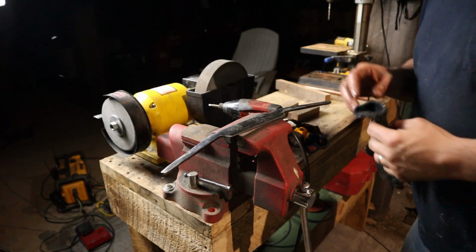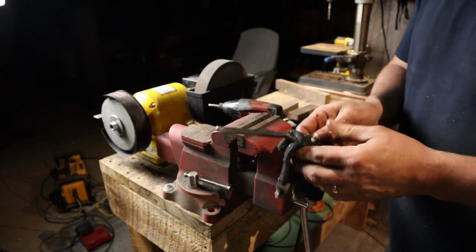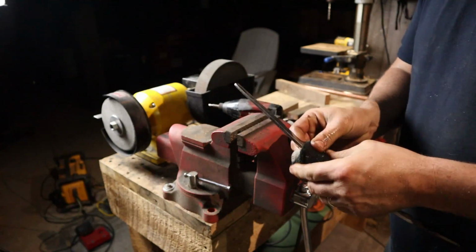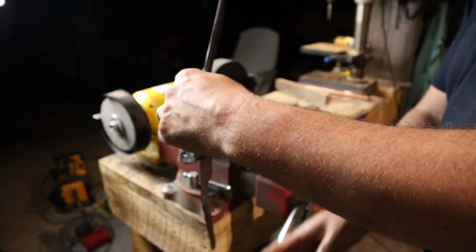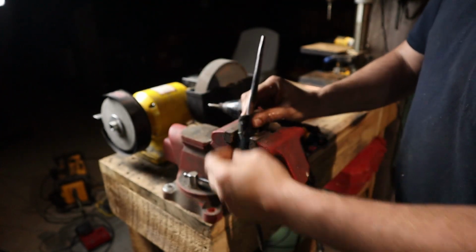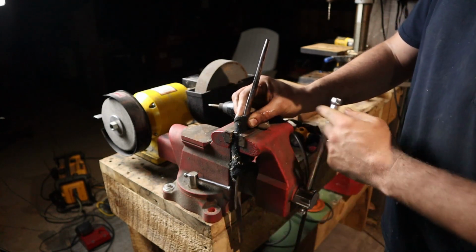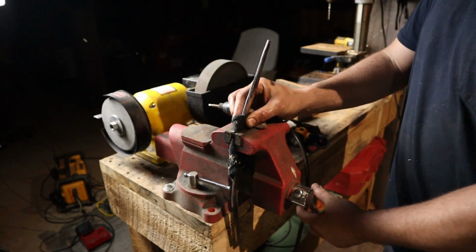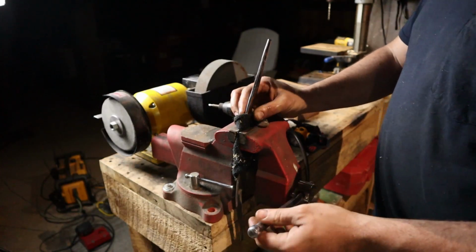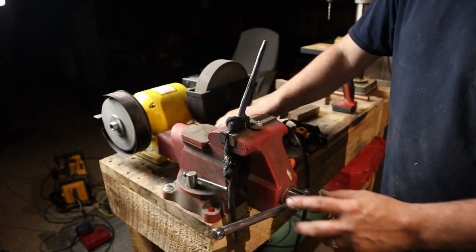All right, we're going to do the left one first. Now, you think I could find a wet rag around here that I could wet down for this? Hell no. So, we have a glove. You kind of want a heat sink on this, because you took all that time to heat treat this blade, you took all that time to temper it right, and the last thing you want is it being ruined on you and having to start over.